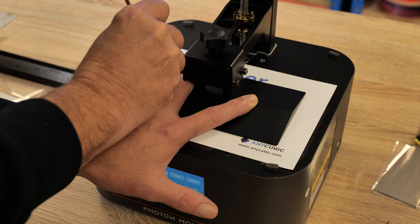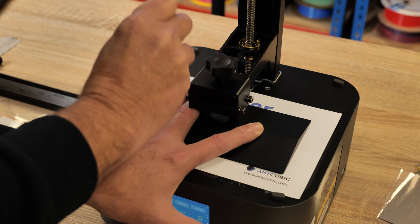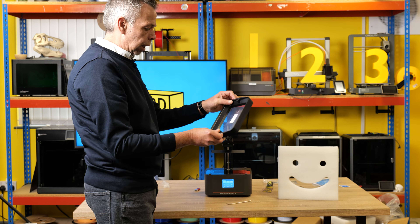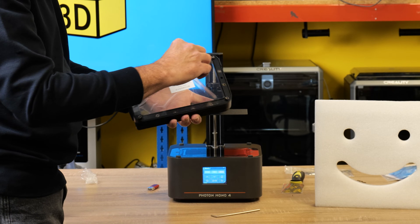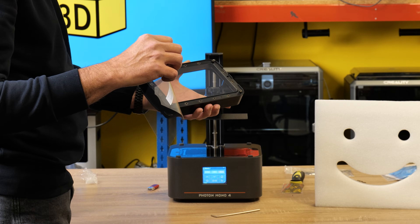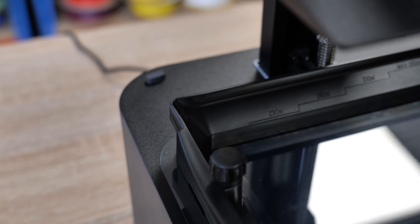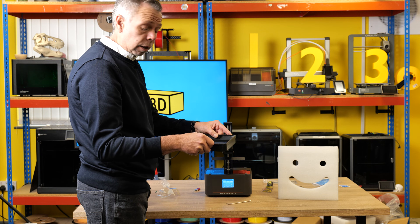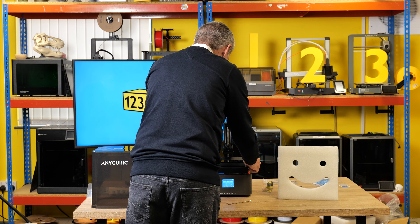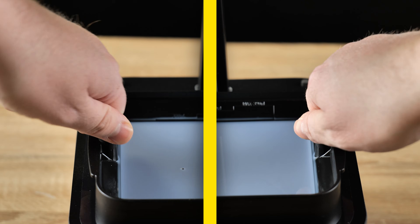We are homed. Now, with a little bit of pressure holding the plate down in a criss-cross formation, tighten the screws back up. Now on the vat there's protective film on the back. The vat has a little funnel part for emptying the resin back out. Maximum fill for the vat is 390 millilitres — it's all very clearly marked. It does have locator feet, so we get the two little screws and snug that down.